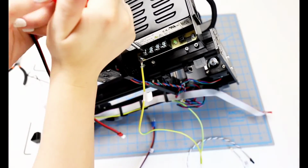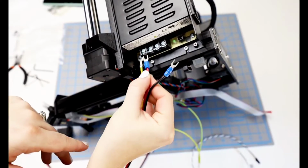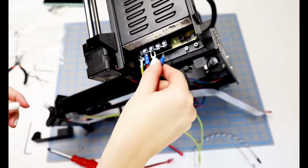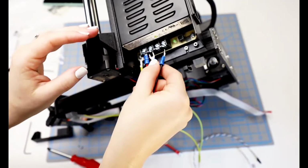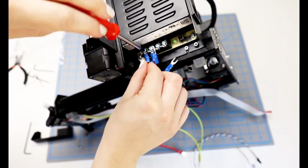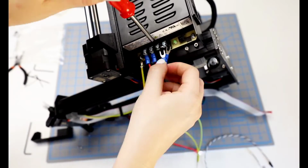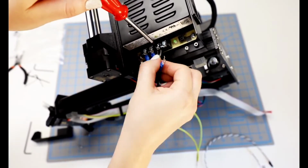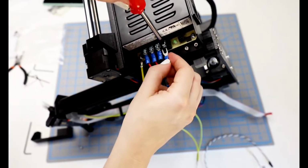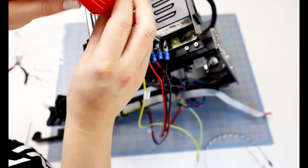Okay, so I just go through and unscrew the screws a little bit as I'm getting ready to slide the cables in. And then I start first all the way on the left with a red one. Then I grab the other cable and the next red one goes in position 2. And I make sure that both of those are tightened again. And then I take the black part of the first cable and slip that in on the third screw. And then finish up with the second cable, the black side of that. So that one's in position 2 and 4. And make sure everything's tightened again.